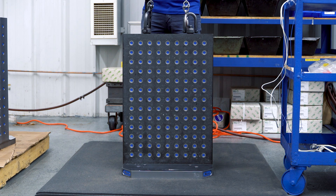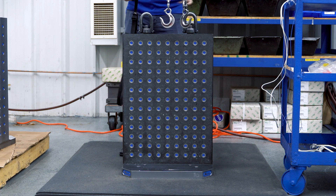We might ask the question: why does damping matter in a tombstone? When we think about machining, we can either have a stable machining operation or we can have chatter, which is a self-excited vibration that leads to large forces, large deflections, bad surface finish — something we want to avoid. The higher the damping, the less likely it is that we'll get chatter when machining on that tombstone.